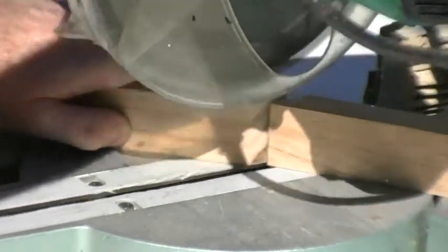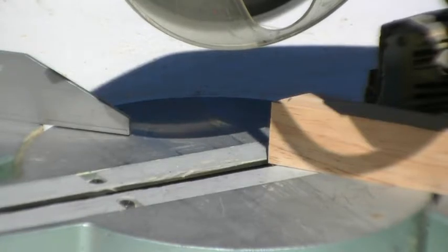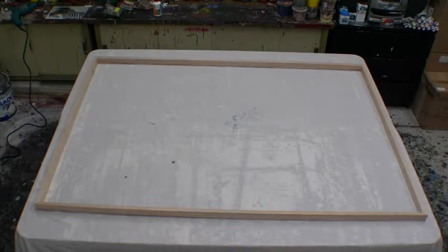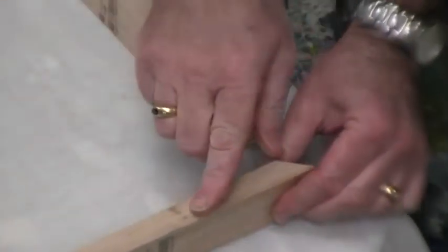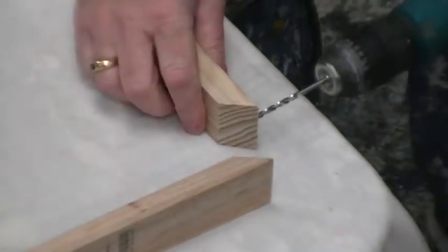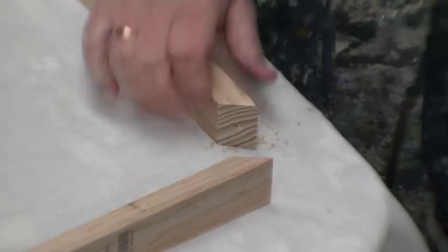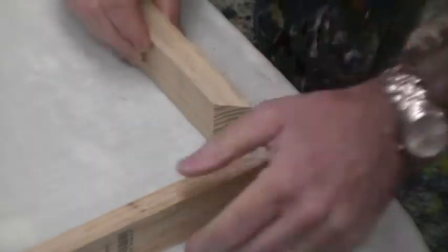Always be extremely careful when using your electric miter saw. Once we have our four pieces cut, we can lay them out onto our table, putting the joints together at the 45-degree angle with the bevel facing upwards on the table. You can then line them up and get ready to start the join. Using your drill, drill through the center of one piece so your screw will go through into the center of the other piece.